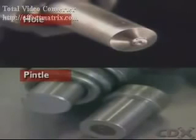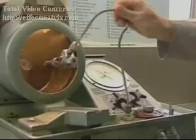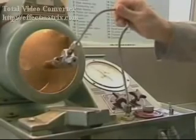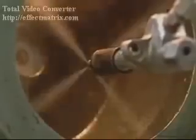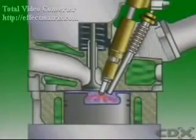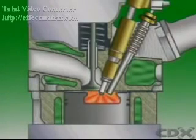There are two main types of injector nozzle: hole and pintle. Hole type nozzles are commonly used in direct injection engines. They can be single-hole or multi-hole, and they operate at very high pressures, up to 200 atmospheres. They give a hard spray, which is necessary to penetrate the highly compressed air. The fuel has a high velocity and good atomization, which is desirable in open combustion chamber engines.